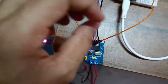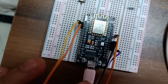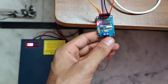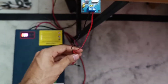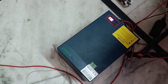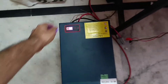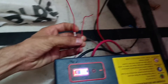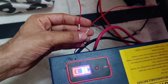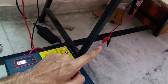This is the interrupt pin which is connected at D4 of the NodeMCU ESP8266. It has two wires: CAN H and CAN L. This is a random CAN-based device which has a two-pin CAN H and CAN L. We can connect these two pins to these two pins — CAN H to CAN H and CAN L to CAN L.